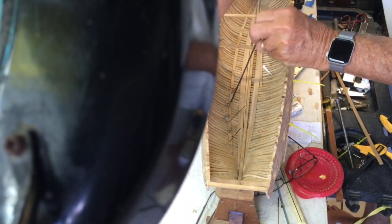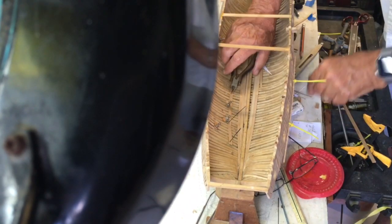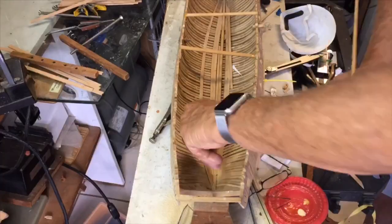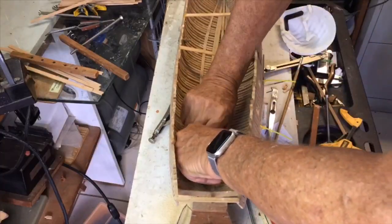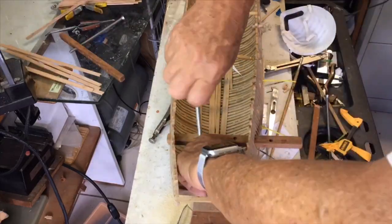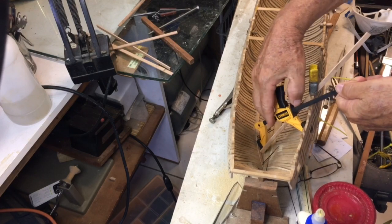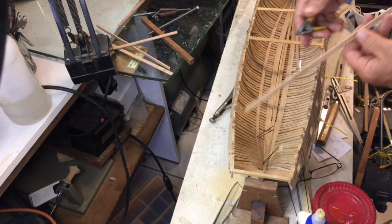If it's not, when I put in strake number 7, I'll start to taper a little further forward. My little clamps are really working quite well now. I'm getting used to them, figuring out how to take them in and out, and they will only improve over time. I haven't decided yet where I'm going to put a whole bunch of dowels throughout the whole piece, remembering these pieces are going to be totally covered up in the end.